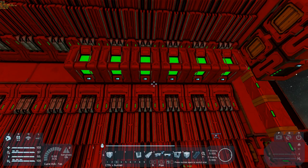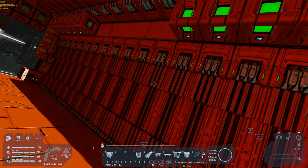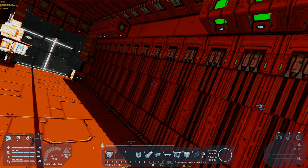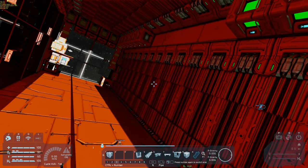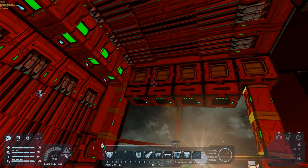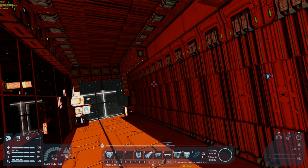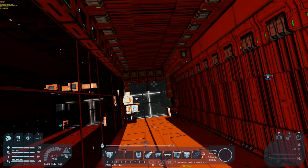You could group everything together and have the roof doors and the front doors opening simultaneously, and that's fine. In this case, I'm setting them up independently, so you could open either the upper doors or the forward doors and the system works the same. It does use groups in common — really to say the supply air system and the depressurization system — those are common to both.